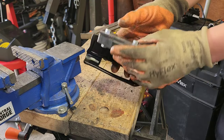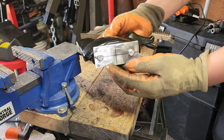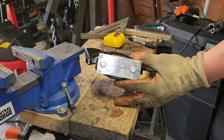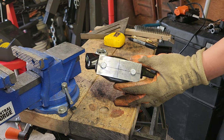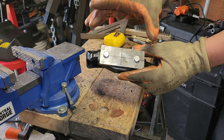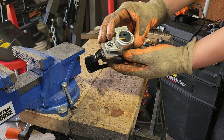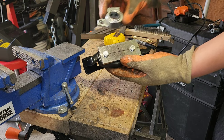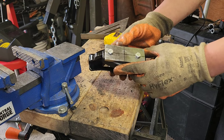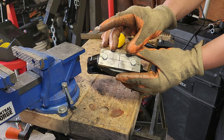It turned out fairly nice — could use some longer bolts, but it holds on there nice and snug. The holes aren't exactly centered; I think when I started drilling on the drill press the piece of metal scooted over a bit. That's okay because it holds on there well. Later we could trace the silhouette of the duckbill and cut the plate to fit exactly into its recession for a cleaner look. For now we'll roll with this and weld the square tubing into the center hole.